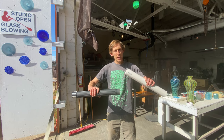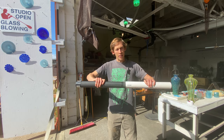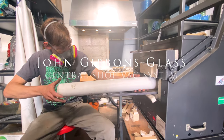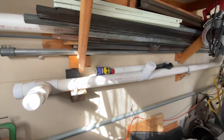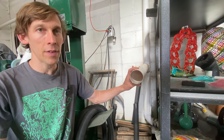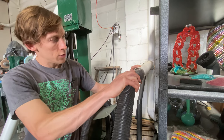So I'm going to show you how to heat up the PVC pipe and shove the shop vac utensil into there so that they fit together. I chose this three-inch pipe to build my central shop vac out of and the trick is how to get this two-inch shop vac tube to fit in there.